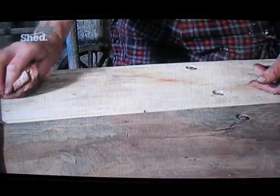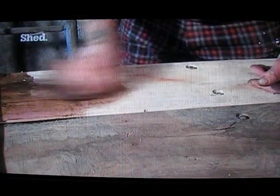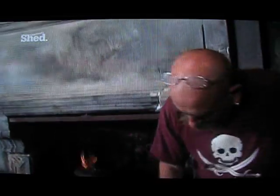I don't like polyurethane varnish, and paint ain't right for this build, so I'm going for a reliable option. There's a few brands of wax on the market that are really easy to apply. You put them on, leave them a few minutes, and then buff them up to a really good shine.